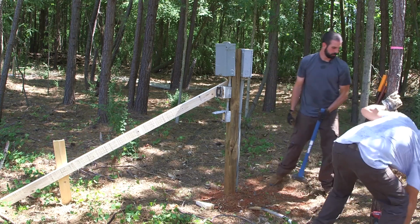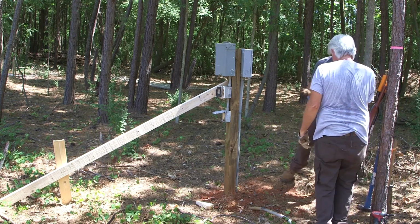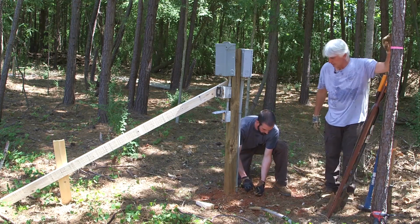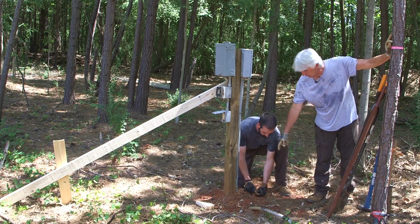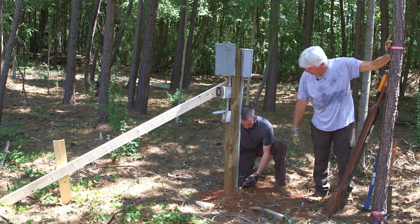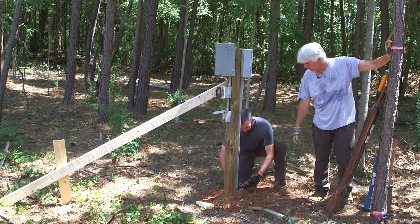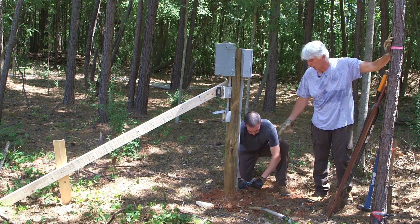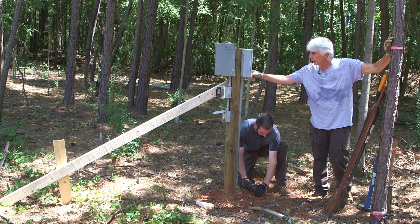Okay. You want to do the honors? Gee, thanks. Got to have an acorn nut, and you lock the wire to the post with an acorn nut. It's just a number 6 ground wire. We actually used a number 4 on that pole, didn't we? Yeah. Some areas I think probably require a number 4. Some require a number 6 ground wire. Runs up into the panel.